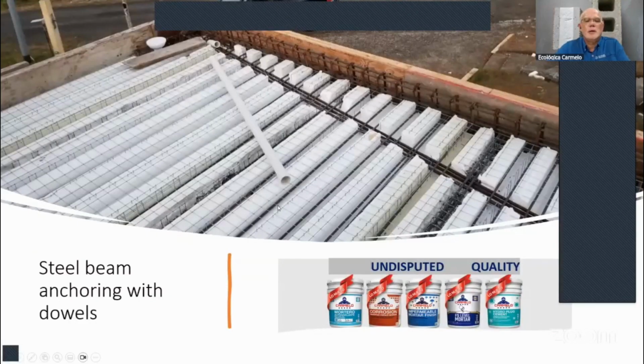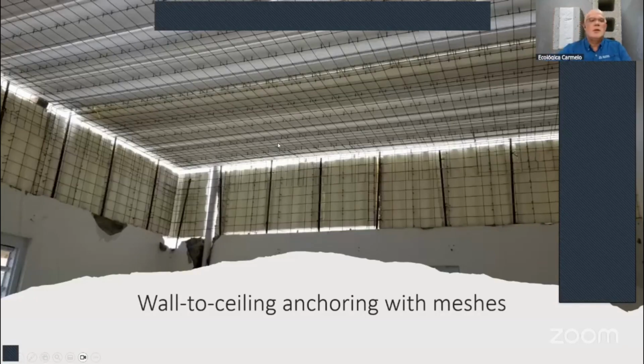Here you can see closer the 2 1/2 inch rebar going into the bond beam at the end of that. This would be your 3/8 inch rings or hoops, and you probably have like 4 1/2 inch rebars on that beam, and then you're forming it. So once you place the concrete over this panel, then you'll also form the beam in there. So it's all monolithic.